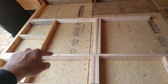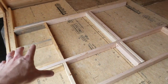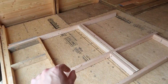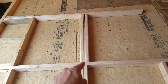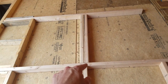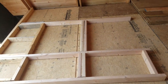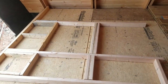Normally what you'd do is have little cripples holding up the header, but I don't want that, because one of the things that's going to make this look really good — and the CAD drawings have made it look really slick — is keeping these joists really thin so you have lots of glass area and very little framing. The way I'm doing that is the top two-by here is going to have metal brackets anchoring it to the studs, so the top one has extra metal bracing to hold it in place plus regular nailing to the studs. Hopefully that's enough to make sure none of the weight gets transferred down to the window unit below it. Worst case we'll take the window unit out and reinforce it, but I don't think that's going to be an issue.